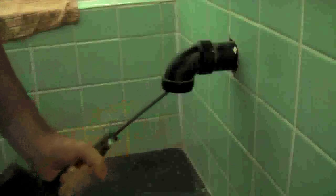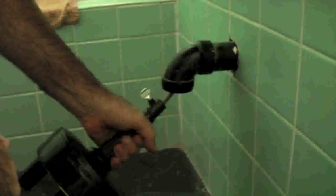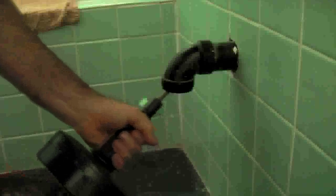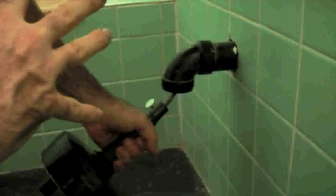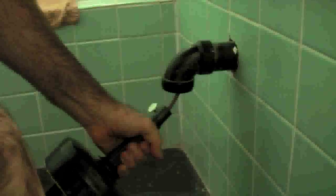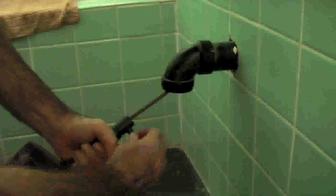Pull the snake back and forth a bit. You're probably not going to feel the obstruction because most obstructions are just gunk, so it'll probably go right through it. As for how far to go: if this is the only drain causing problems in the house, 10 feet of cable should be more than enough to clear it out. If it doesn't, you're probably looking at getting professional help. When you're done, pull it out and feed it back in. Depending on how squeamish you are, you may want to use gloves. I hope that has helped you with your clogged drain problems — thanks for watching and good luck.